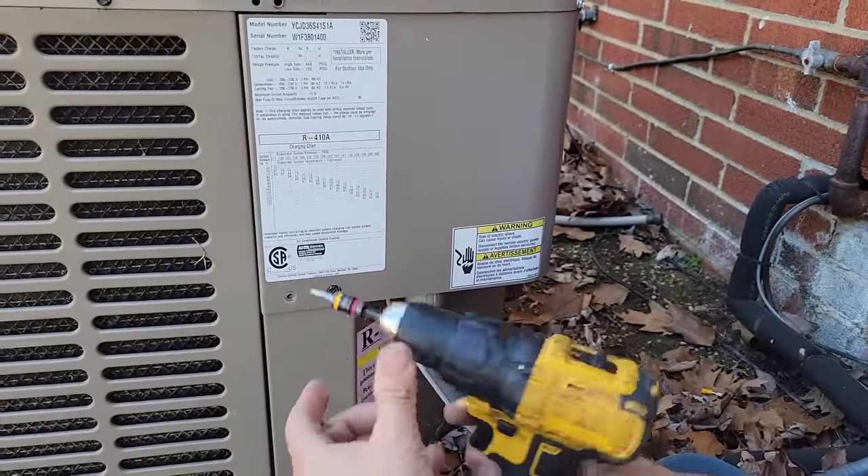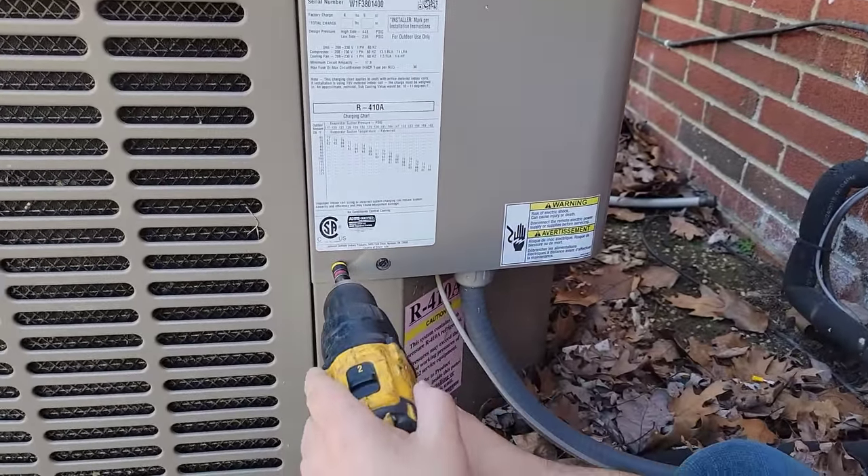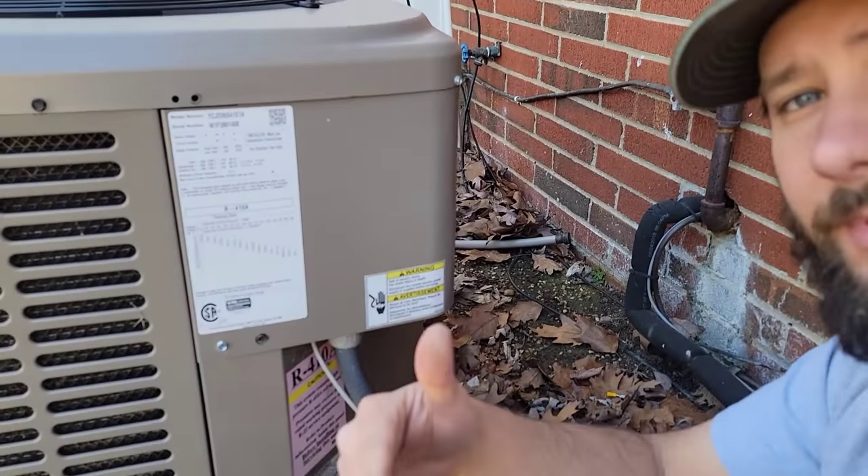Link in the description for the product. It's around $150, and the competition sells the same product for double — about $300. I would definitely check out ICM Controls. Link in the description for the ICM 870. Make sure you check which model you need — the 9 amp or the 16 amp. Mini splits and other high-efficiency equipment already have inverter boards and three-phase components with built-in soft start features, so you don't need to install the ICM 870 on those.